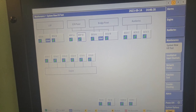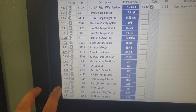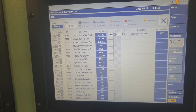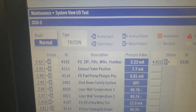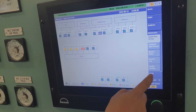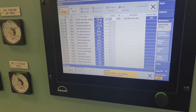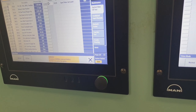From the main operating panel, you have to choose maintenance and select which cylinder we are going to test. As you can see, there is a start air pilot valve and you have to remove it from normal. When you are going to test, just remove from normal and then an alarm will come.